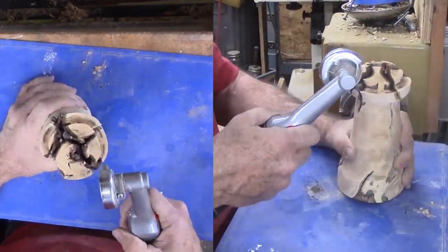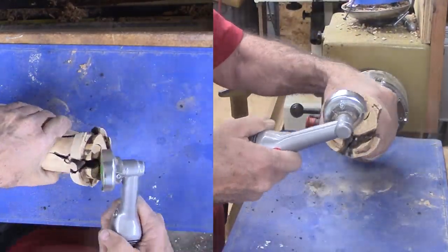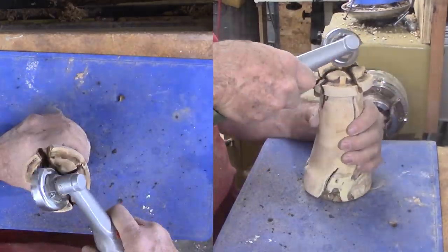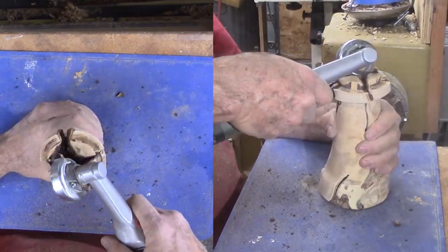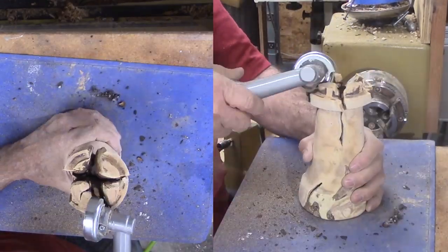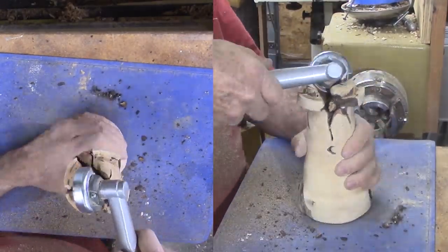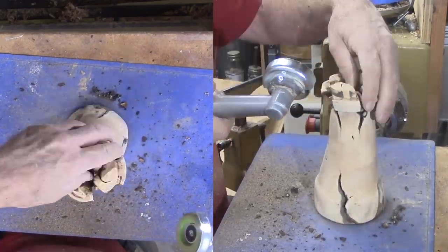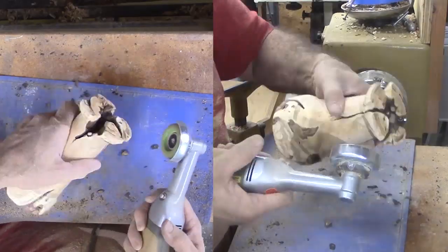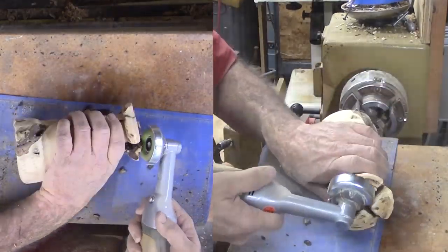Originally I had planned to part off the vase about an inch and a half from the very end. With this sloppy end, there is no way to safely do this. So I am resorting to my right angle tool with a rasp bit. As I take off the wood beyond the tenon, I am looking at how the individual roots have spread out and the bark inclusions between them. So instead of hacking off the bottom, I am going to follow the roots and use them as feet.